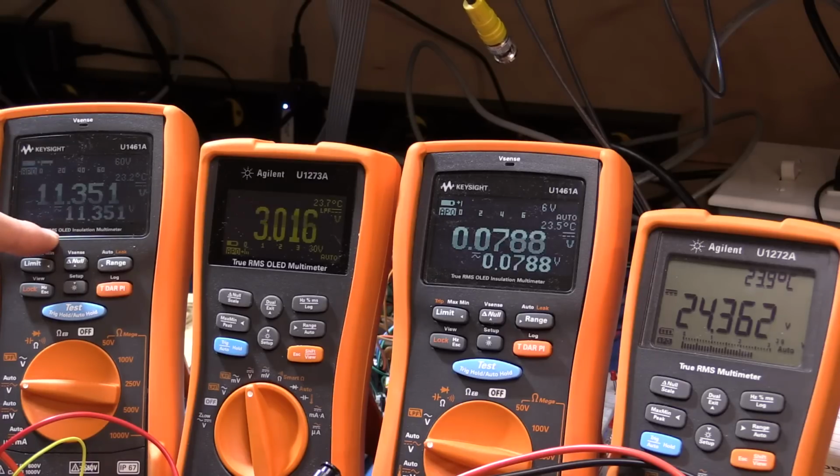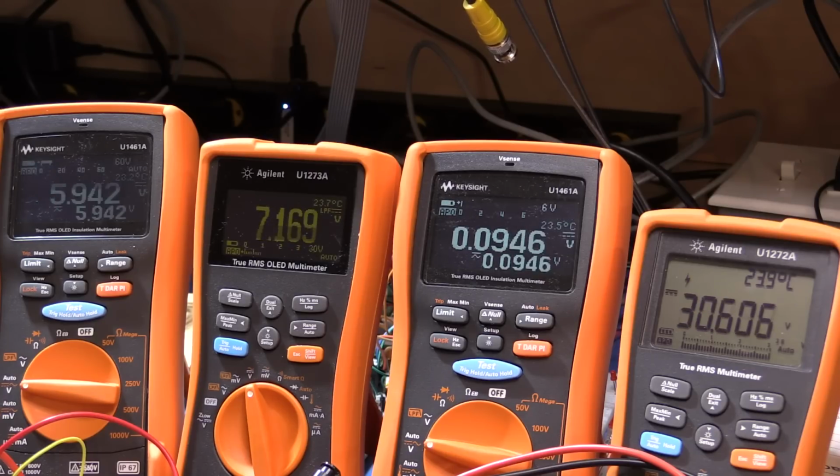And the output of the voltage integrator is sitting way high because it knows there's an error and it's basically ramped up to the positive rail. The minute I allow the current to go to max, the voltage one will actually then take over, because of the way that the two are set up, it's going to flip because of the difference in the 2 op amps and the sensing and everything.